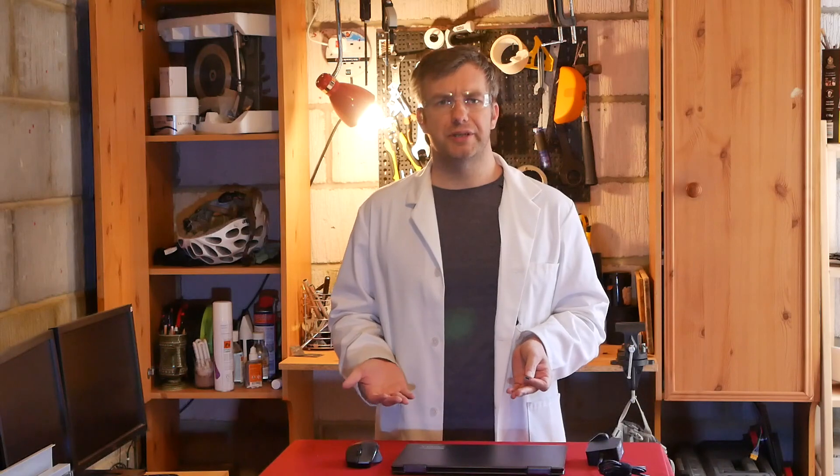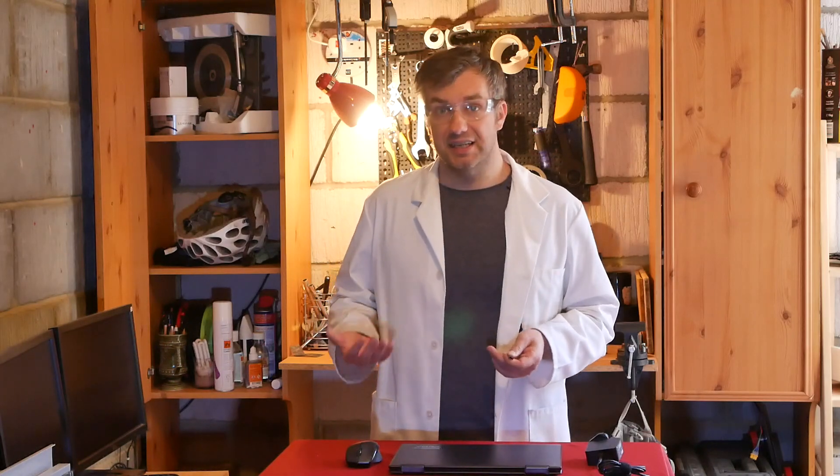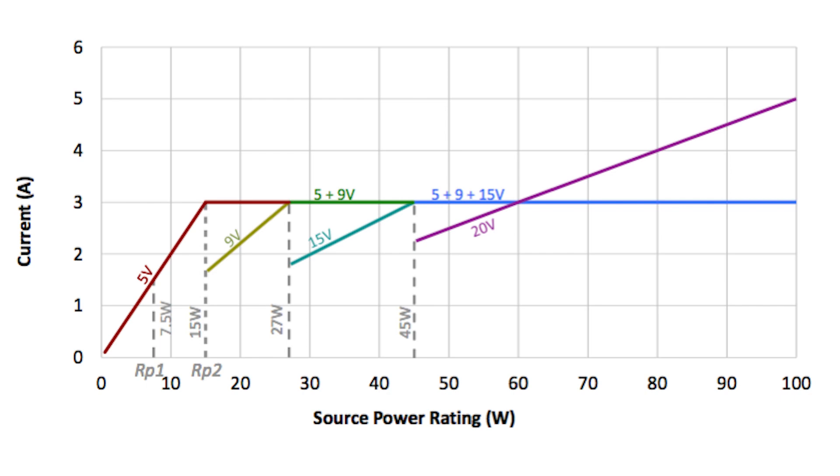But it is worth it. So today I'm going to take advantage of USB Type-C PD — PD stands for power delivery — and hack my laptop. USB Type-C PD is clever in design, but I'm not going to go into many details. For the purpose of this video, you need to know a couple of things. Not all USB Type-C ports are the same and not all of them come with the PD standard. The standard USB Type-C port can transfer up to 15 watts — that's 5 volts and up to 3 amps. The PD specification is split into 4 different voltages: 5, 9, 15, and 20 volts.